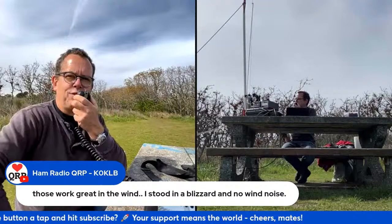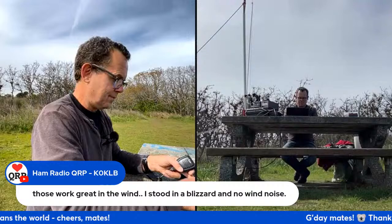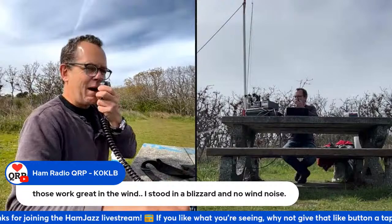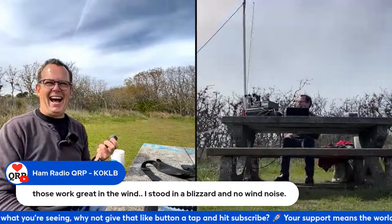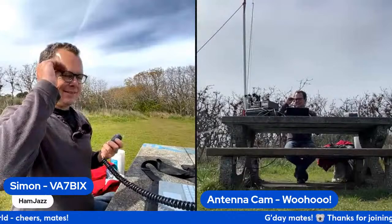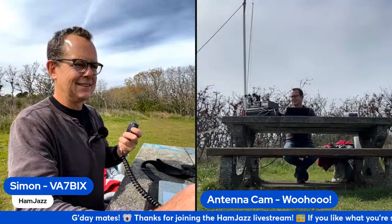73, this is Victor Alpha 7, Bravo India X-ray, QRZ. Kilo Oscar 4, Golf Alpha Romeo. Hey, there he is, g'day, Dave. A lot better than yesterday, mate. You're about a 5-6, mate. QSL, buddy. 5-4, Simon. Roger, mate, how many watts? Are you running 83 or what? 83 watts, my friend. Oh, you are a legend, mate. That is absolutely fantastic. Now, why 83, buddy? I don't know. It's just how my ALC is set. At 83 watts when I speak into my mic, I get 80 watts out. Roger, mate. Well, you're rocking 83, buddy, as always.